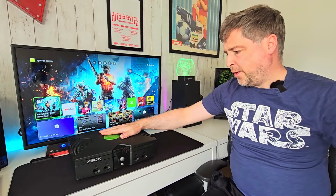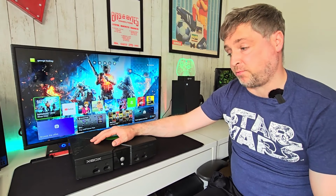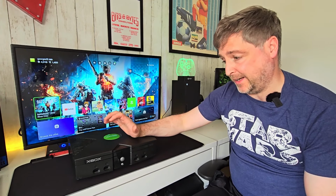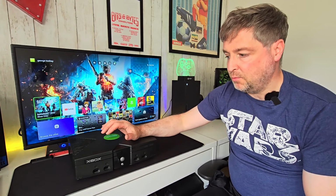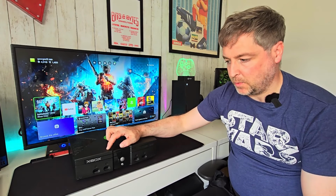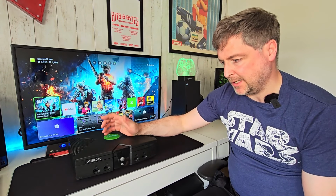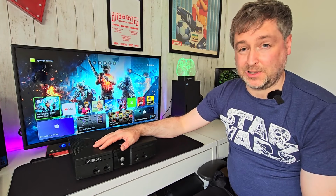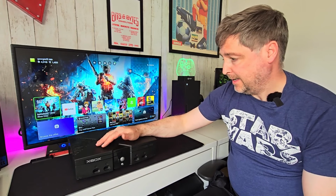Right, so that was phase one over. Now, the second phase is probably going to be the DVD drive. It's going to basically just get cleaned out, stripped down, re-oiled. All the rails are going to get re-greased. I'm going to sort the belt issue out as well. That's what's stopping it from coming in and out sometimes. Possibly a new belt or just put it in warm water and give it a good clean. That's what I've always done, to be honest with you.